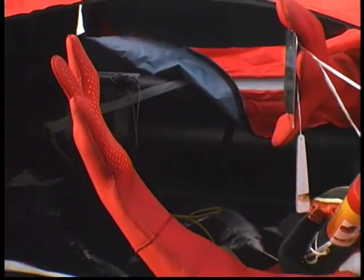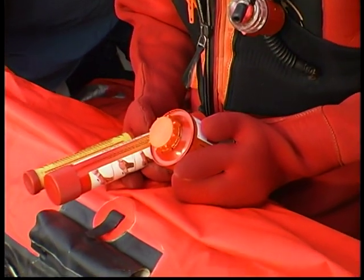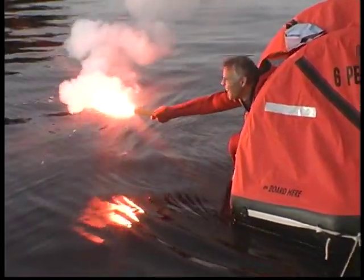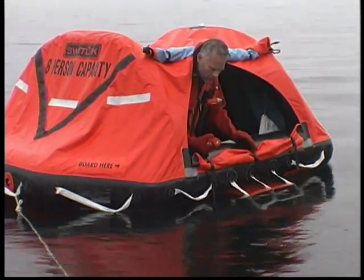I saw the C-130. I waited for him to bank toward us where his line of visibility would be down towards us, to give us the best chance of being seen, and so I shot the parachute flare. Practice aiming your mirror by lining up your target in the notch between two fingers and shining the light in the notch — mirrors will work even on cloudy days. SOLAS A and B packs contain smoke, handheld, and parachute flares. Ask your life raft repacker to explain how the flares in your raft operate, as they may operate differently than the ones on your vessel. Read the instructions on the flares before you need to operate them at night or in rough seas.